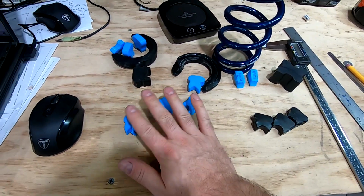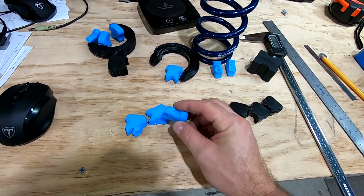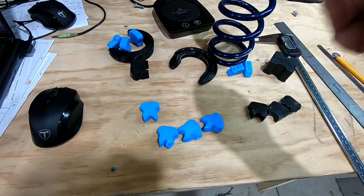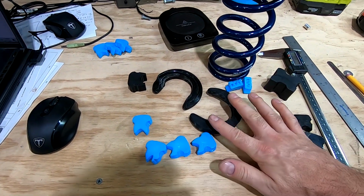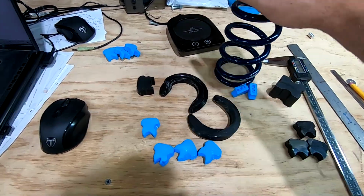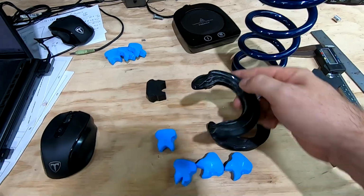So then I thought, okay, I need to kind of make my own deal. That's where these came about, and these actually worked really well. Problem is, at the end of the track day, when everything was all warm and I put them in, they obviously deformed on me. One last thing that's kind of unique to my car, or if you have our coilover conversion kits, which you can't see them in there: there's enough room to fit just a straight up thick spacer underneath of the spring when the wheels are dropped, or when the car is jacked up and the tires are in droop. So that's what these are, but again, you can see, the warmth got to the PLA, didn't work.